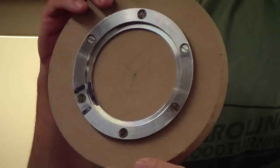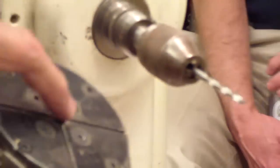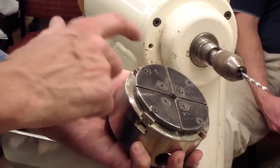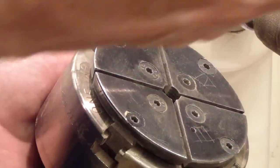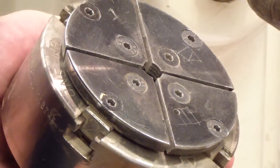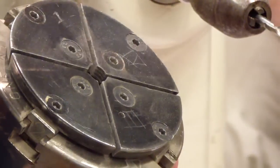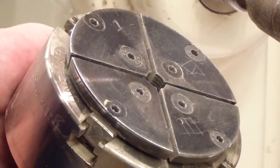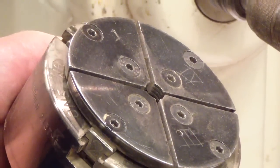You can buy the jaws that have that real small high tower in it. Cut that thing off and get rid of it. And then turn these upside down and cut your dovetail on here so that it fits those. And now you can have a set of those made up. You can have them for sharpening, for buffing, for holding. You can have it just to throw a scrap piece on and super glue it. And it fits dead on every time. It's just really good.